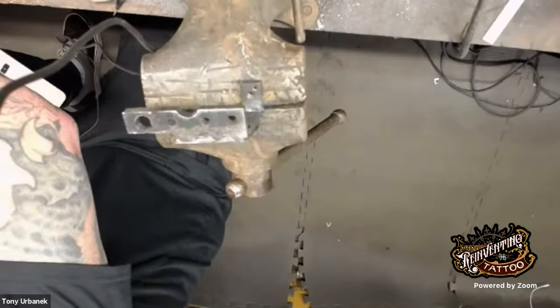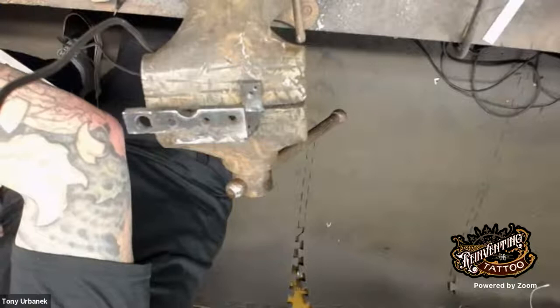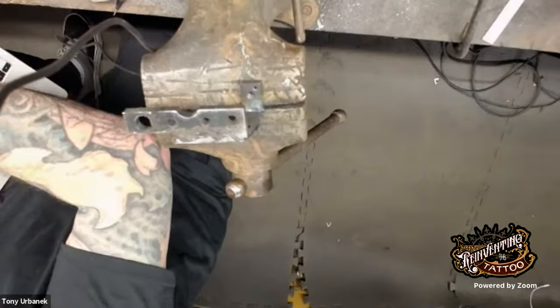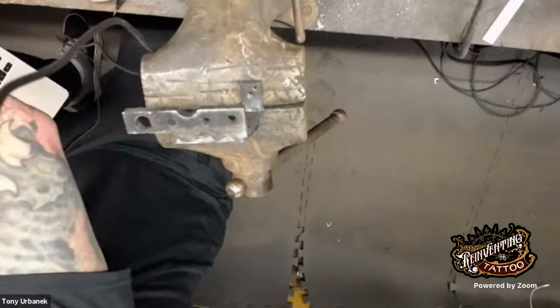We start from scratch, just raw pieces of flat steel, 3/16 inch bar, 1/4 inch bar, some collet tubing. I actually use just brake tubing in my collet, some screws, some 5/16 rod, 3/8 inch bar. We made everything on here, contact screw. The only thing we didn't make are the nuts and bolts. Binding posts, we drilled and tapped, but I used the stock.